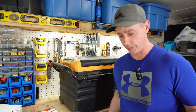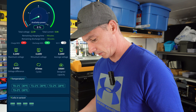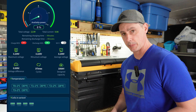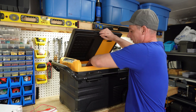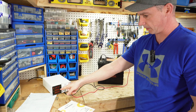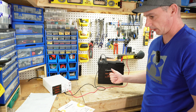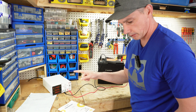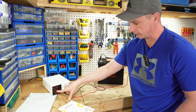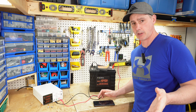Okay, welcome back. As you can see on the app, we are minus 1 degree on temperature sensor 0, minus 1 on sensor 1, minus 2 on temperature sensor 2, and minus 2 on temperature sensor 3. So we are good and frosted. We have 0 amps, and then I just heard a click inside the battery — the heat pads are heating. On the bench power supply we have 2.627 amps going in, which means that is powering the heater.